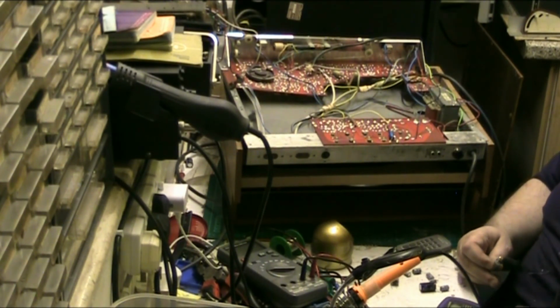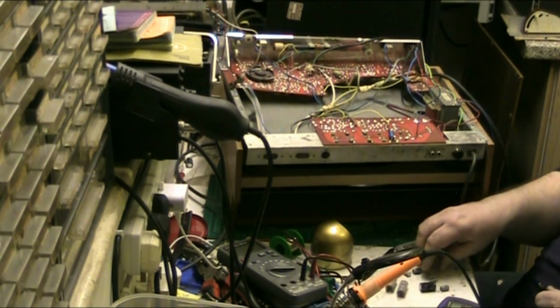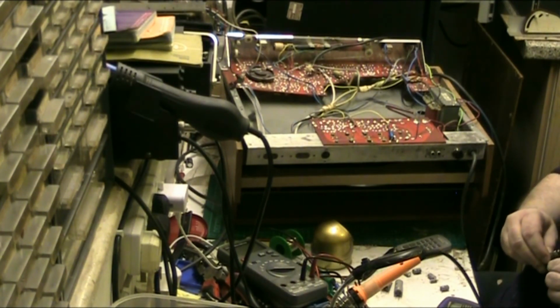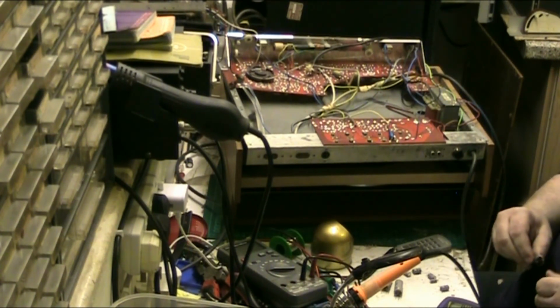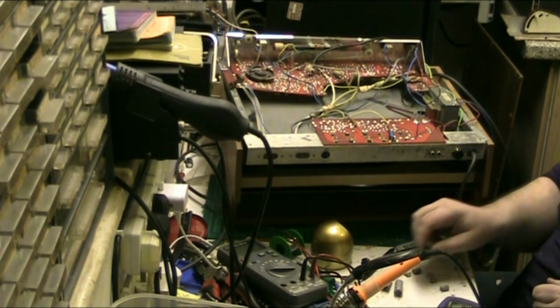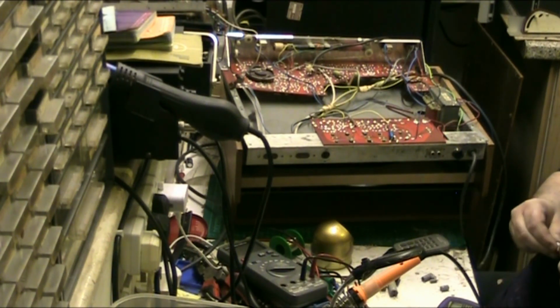576.2 microfarad, 0.04 ESR. So they're okay. I won't reuse them for anything, because you could put them in today and it could be gone tomorrow. But then again, it could be all right in another 20 years. Well, that one's 312.4 microfarad, 0.05 ESR. And that was a 330, so that was a bit under, but that's not too bad even.